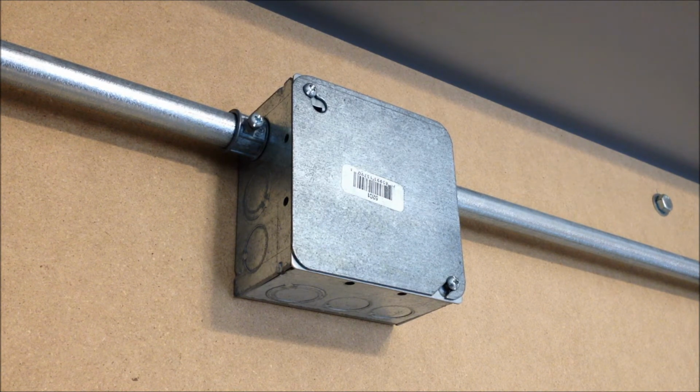So with that, the horn circuit is set to be continuous on, and what normally is the horn circuit, it's just NAC 1 in this case, and then NAC 2 is set to be silenceable with the silence button and running into the horn in input. That allows me to silence the chime in the chime strobe over the 2 wires with the SmartSync protocol.